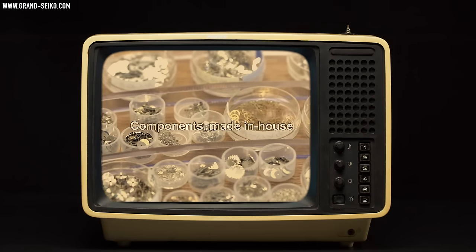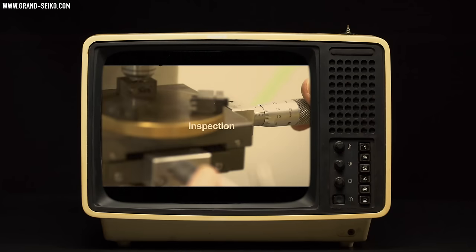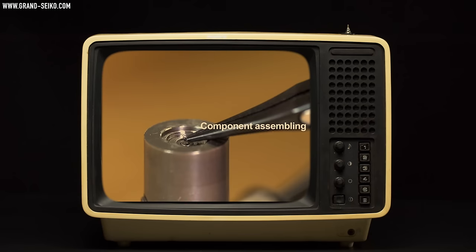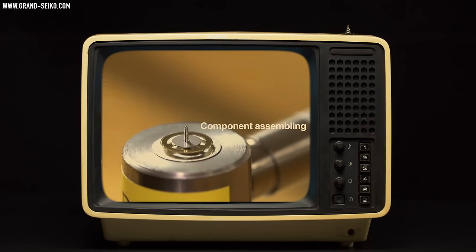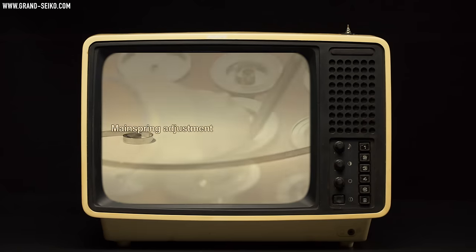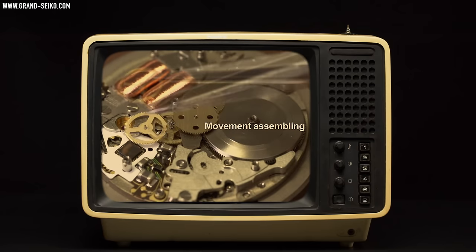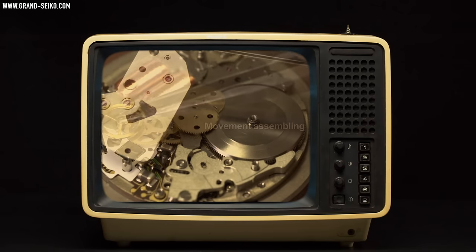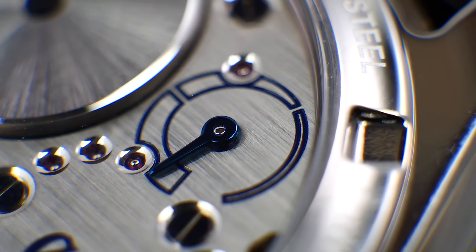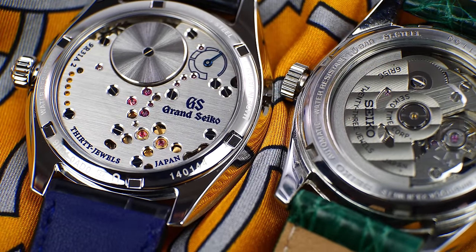So what makes this caliber superior over its predecessors? Well, the 9R31 also boasts a further innovation of having a clever dual spring barrel system that contains two mainsprings set in parallel, therefore able to deliver a highly impressive power reserve of 72 hours, which is of course 3 days. And astonishingly, it manages to do this while still being relatively slender in scale. As with any high-end caliber, it's completed with beautiful beveling, contrasting finishes, thermally blued screws, and all the rest of it.